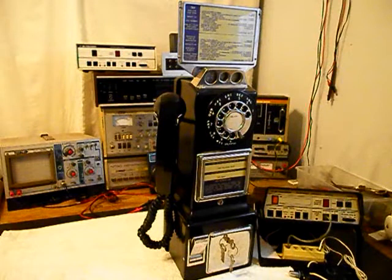We're going to install a modular line port so that you can simply bring up any length line cord, any color that you choose, plug right into the back of the payphone. Makes for a simple, easy plug and play connection. We will also be installing a bell and bell circuit in this unit. We want to go through the coin validator. We want to make sure that all the coins are falling through the coin validator and into the cash box.